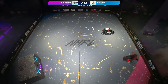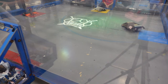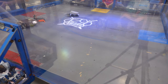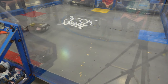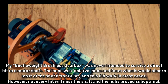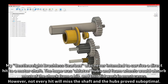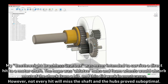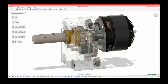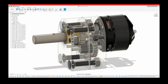There were also a couple of fights in which I simply had a wheel fly off, because the hub was hot glued on and it didn't stick well enough. You can see this happened in my most recent recap video at S.W.A.R.D. Other than those last two failure modes, I think all those other issues are attributable to the 3D-printed gearbox design that I had before. It isn't a flawed design, but it really just couldn't take a solid direct hit without dying. The failures were cheap because it was never the gears themselves or the drive shafts that were breaking, but those repairs were incredibly time consuming and laborious, and it wasn't something I could feasibly do in the middle of the event.